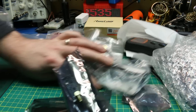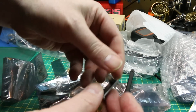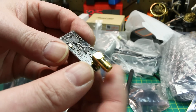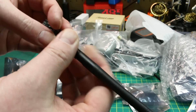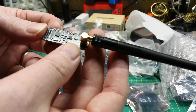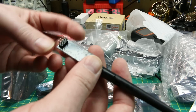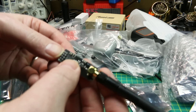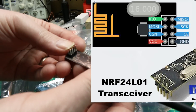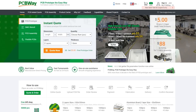Next up, I've got some communication modules — I believe these are the NRF wireless communication modules, labeled HW-237S. These are the high-output ones with an SMA connector on them. They're 2.4 gigahertz for reasonably long range and should go for quite a few kilometers. They'll work fantastic for a couple of upcoming projects. The standard pin layout isn't labeled on the board, but I looked it up — they are the standard NRF module layout, so you can just Google the pinout.